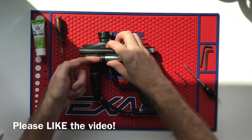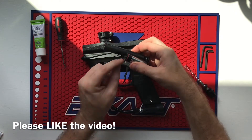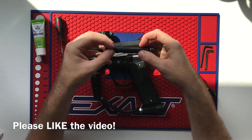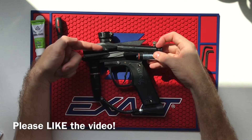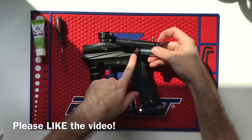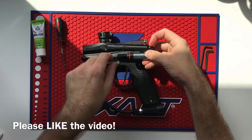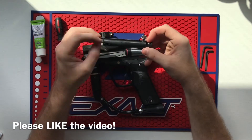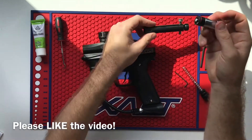The air also pushes the hammer and re-cocks it back. The way it does that is this has a seal because there's an o-ring on here. If your o-ring is worn out or there's debris on your bolt or hammer system or inside the gun, it causes drag, which means it's not going to re-cock. It'll fire but not go all the way back to re-latch onto the trigger assembly. So first, take out the bolt and wipe it down — on a brand new gun you won't see wear, but dirt gets in there over time, which is why it's important to clean and maintain your gun.